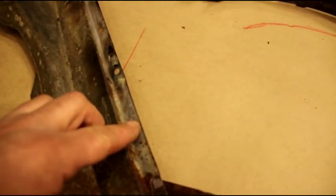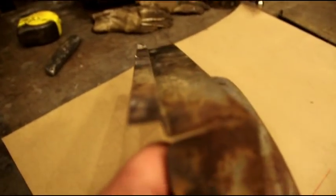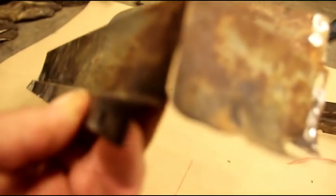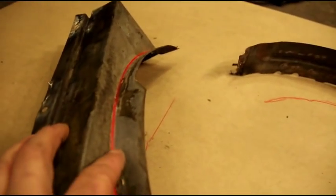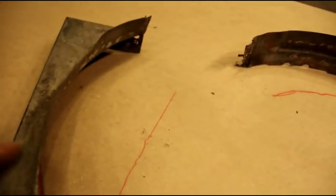As you can see, we've got a real close bend here, and that's what that die is going to be for. I'll show you how that works in the press brake. We can make that real tight bend there, back to back, reverse bend, if you will. And then we'll get some tipping dies out, and we'll tip this flange up here, and we'll get everything put back